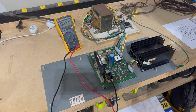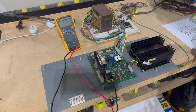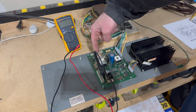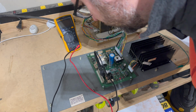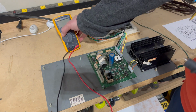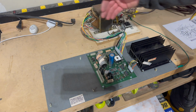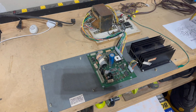Look at that. I still want to go ahead and rebuild this power supply PCB just for the heck of it. Again, these are the original capacitors. We've even got the stickers with the Williams serial number and warranty warning. So those are beyond their intended lifespan, and I do want to replace those. We'll put new fuses in, replace the other header pins, and replace bridge rectifier number 1, which is sort of known for going bad.